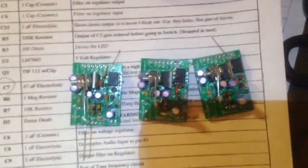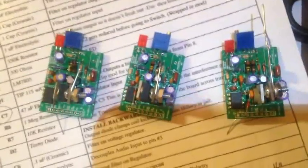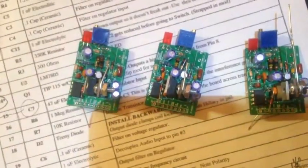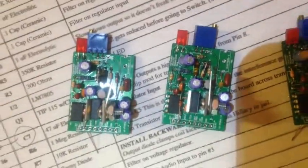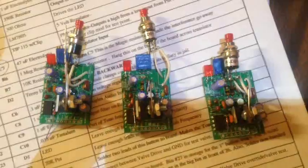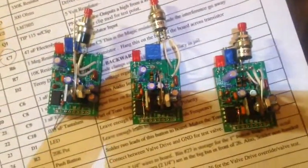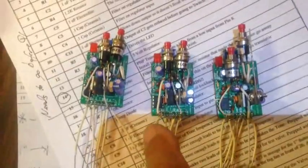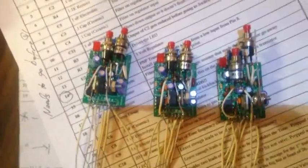It's 12:02 a.m. I'm down to step number 22 and ready to put in the 0.033 tantalum capacitor, the LED, and the 20k pot. It's 12:09 a.m. — I've got the diode, the LED, the pot, and the 0.033 in there, and now it's time to do the two push buttons. At 12:14 a.m. I just did one push button because I decided I better do the octal wires before I do the other push button. At 12:34 a.m. I've got all the octal socket wires on, the second button, and the diode is connected.